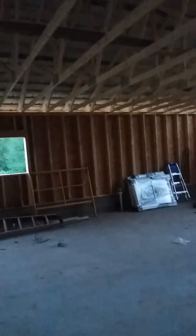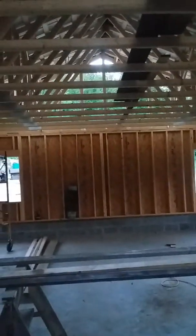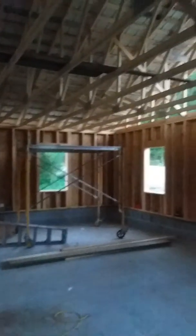Tin, drip edge, everything is like double screwed. These are, as you can see, braced at the important spots for now, and we'll keep going on and do a little extra. I was worried the two-foot overhang was gonna look goofy, because it's two foot from here to here and it's also two foot from here out. But I do like the looks of it because it's a smaller house. The tin turned out really nice. Tin's kind of hard because you got to make sure everything's square. If you use sheeting on your roof, as long as your sheets are square and going on square with the trusses, you're pretty well good. But I use strapping, so it's a little extra work — well, a lot of extra work.